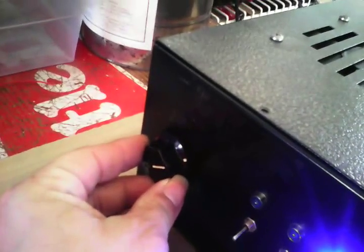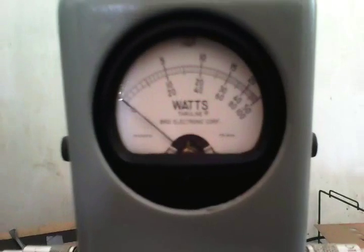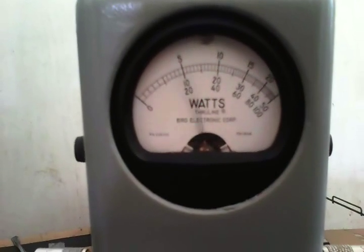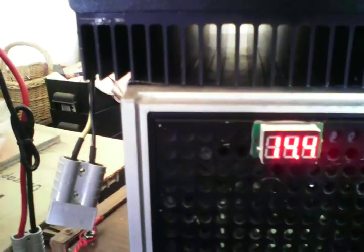I'm just going to turn this variable about 75% right there. Just 75% — I'm just going to quickly burp it. Go ahead and flip that fan on too. It's RMS scale with a thousand watts. There's your 400 bird. Let's see what it's dropping to — about 14.4 volts. 400 RMS.